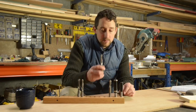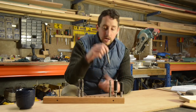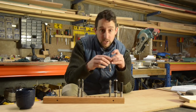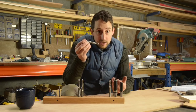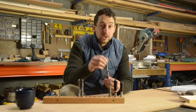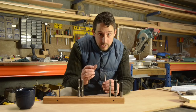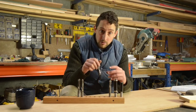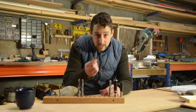Starting with spiral up cut bits: as we said, with an up cut bit the chips are coming back up toward you when you're using a handheld router. So what that means is that you have very good chip ejection. If you're doing a deep cut, those chips are just going to keep flying out. If you've got a vacuum attached to the router, it's going to suck them out really cleanly. You're not going to have a lot of stuff building up in the hole, which means you can do quite fast cuts.